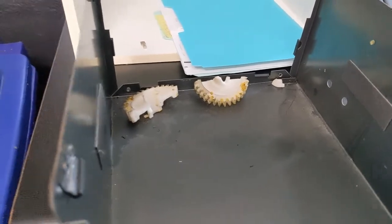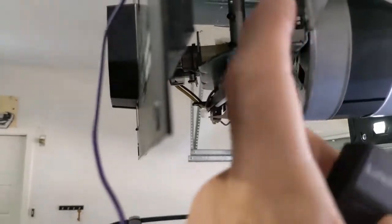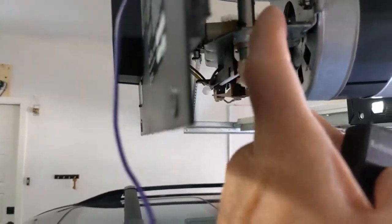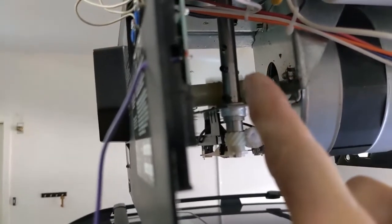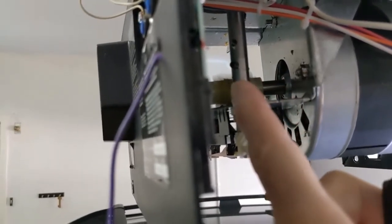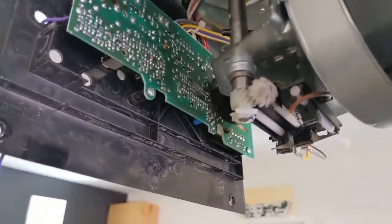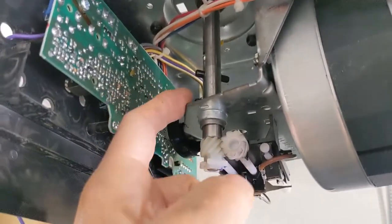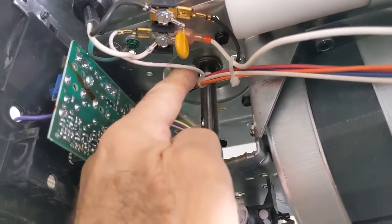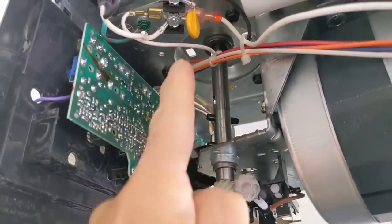So there it is all the way off. Let's look at how it's attached to the axle. It would be in a horizontal position there, spinning around from that other gear. Somebody in the comments can put down what type of gear that is — that gear whose teeth rub up against it. To replace that gear, there are two roll pins right here that hold the gear onto the shaft. And way up there — maybe you can see it — there's a split washer that holds this shaft down from going up.